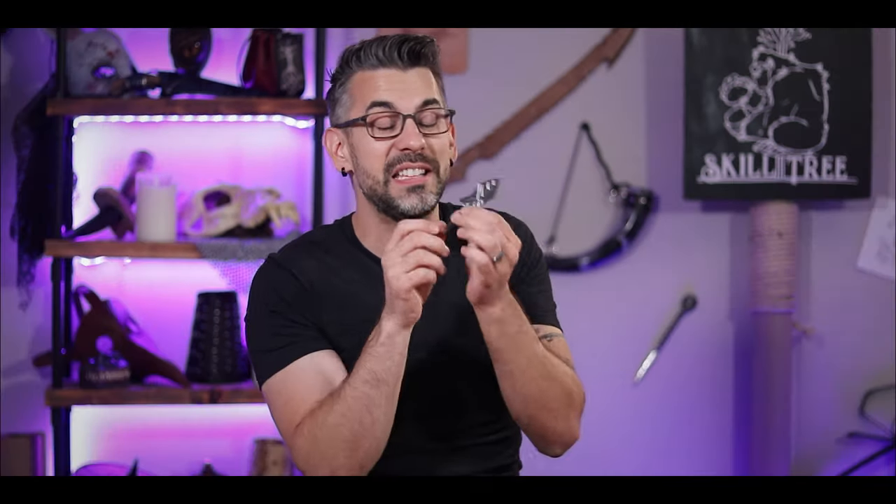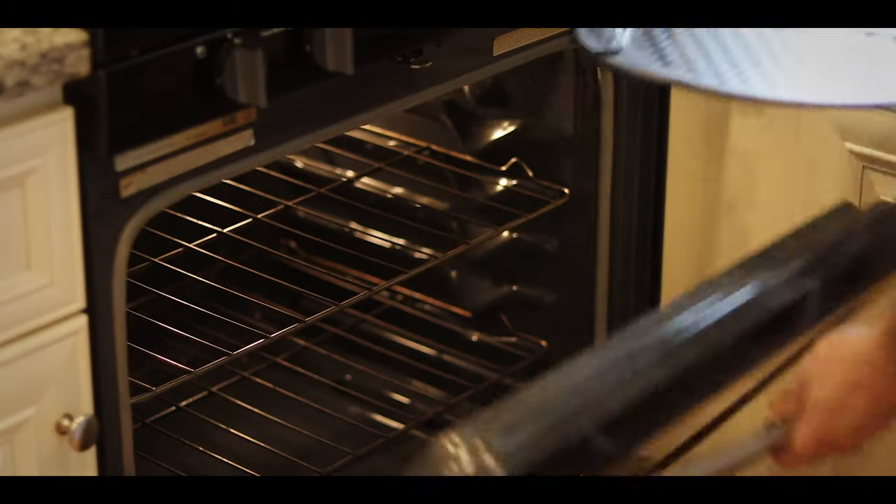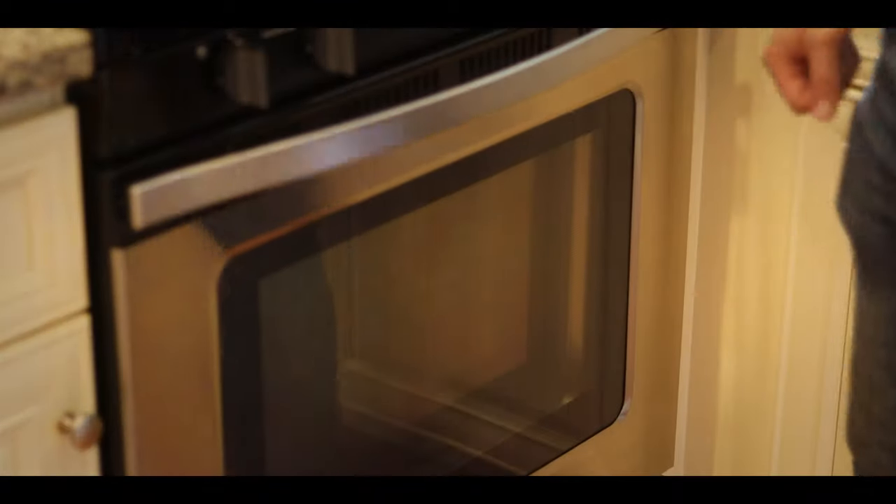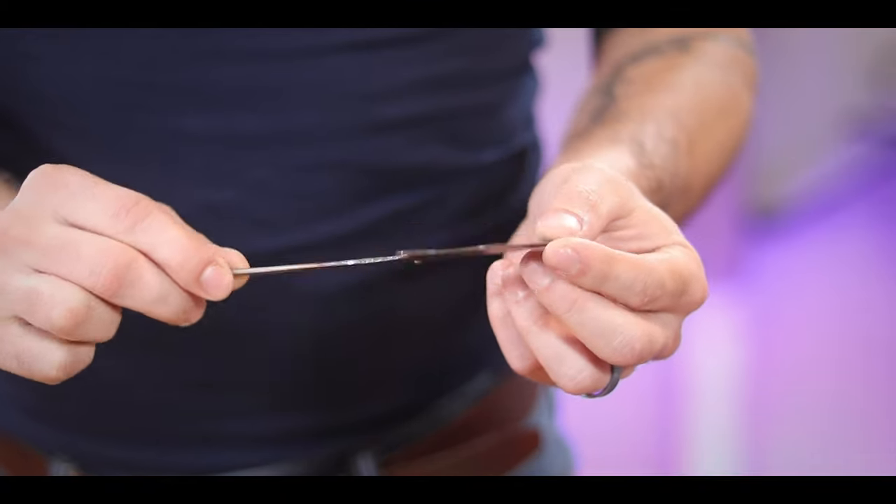Now that it was hardened, it's also brittle. If I ended up shooting this, there's a good chance it would snap right in half. To help circumvent that, all we have to do is temper the blade — I just popped it in an oven preheated to about 230 degrees and left it for two hours. This gives the steel back a little bit of springiness so it doesn't snap on impact. It is spoon steel, so I don't know how high quality it is, but it is razor sharp, and I think it would do the trick.